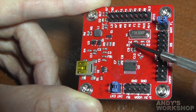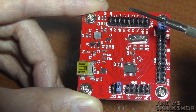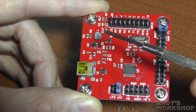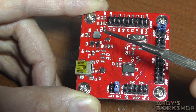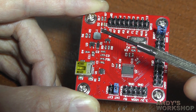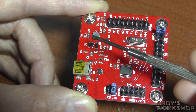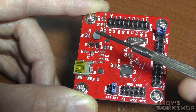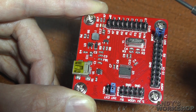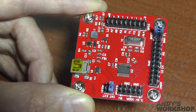Even though this is a small board, I decided I wanted to have a pretty good power supply. One of the things that bugs me about some dev boards is that they usually come with either a very small low-dropout regulator or a big one like the 1117 package, which appears capable of 800mA to 1A, but that kind of power delivery requires a lot of heat dissipation. If you've ever tried to get near one amp on the SOT-223 package they usually put on board, you've probably found your board catches fire before you get anywhere near there. So in this case I decided to include a switching regulator.